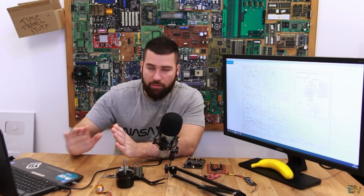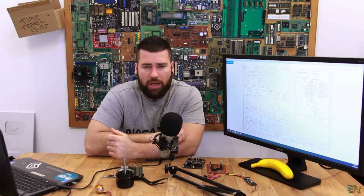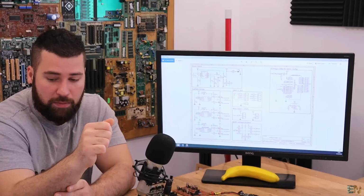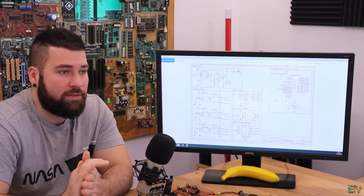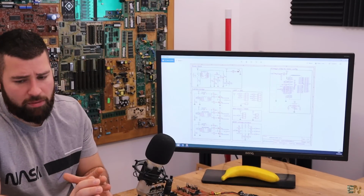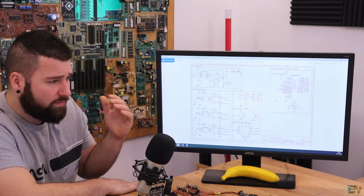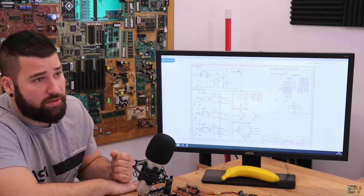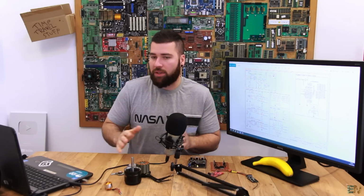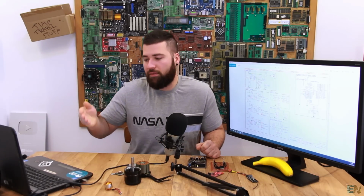And one of the best improvements that I could make is to use an STM32 microcontroller instead of the Atmega328, because the STM is a lot more powerful. It could work at higher powers, at higher speeds, but for now I don't have enough knowledge of the STM32 because I haven't used it that much. And the most important part is that the code that I've made is all based on registers. And for those registers, you have to read the entire datasheet of the Atmega to know how to use them. So since I haven't used the STM32 that much, I'll have to gather again, for the STM32, all the knowledge that I've gathered these last years with the Atmega328.